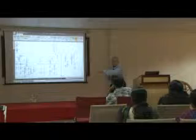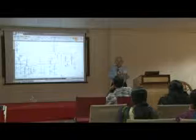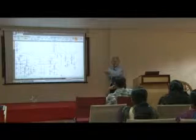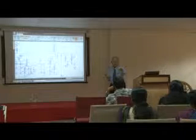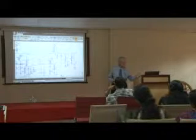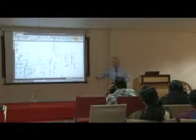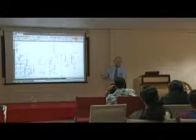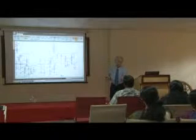And you go back and test your meter again. Maybe the meter broke when you went from here to there, and it read 0 because it was broken. You go back, and it's still reading 13.8. I'm confident that the meter was correct all the time from when I first tested it. I tested the bus, so that really is the de-energized bus. And the next step then is put on the ground clamps and write it down somewhere, get somebody to initial it that I put it on, and make sure it's in your sequence that sooner or later you're going to take it off before you close the breaker.